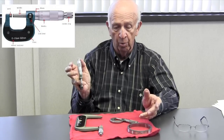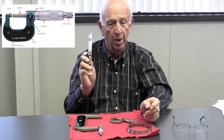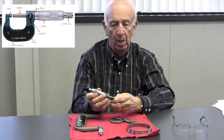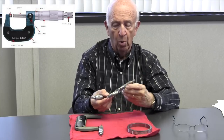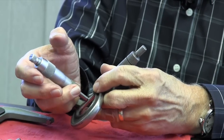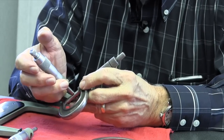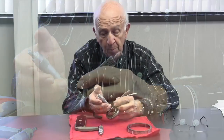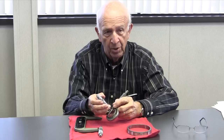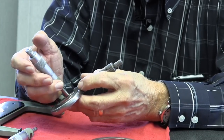It's pretty safe — you can rotate the thimble here and you've got a good grip on it. As far as opening it up, say you want to open it up to three-quarters of the way — save a little time, just run it up and down your arm. And when you're going back you want to be careful that you don't jam it all the way down, so when you get close you stop. What I really like about using a micrometer is the feel — this is really a touch thing. This goes into art form. This is not just being a toolmaker — it gets out of that realm of measuring and goes into being art. There's a big difference between being a mechanic and being an artistic mechanic.